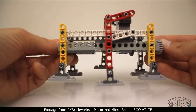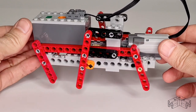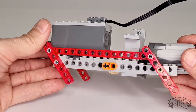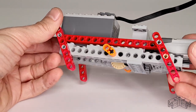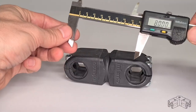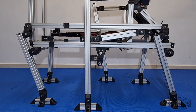This one is driven by a single motor. This didn't look too complicated, so I felt challenged to carry over this working principle to the Infento system, just in a bigger scale. There is a principal shaft that drives two cranks with 180-degree offset, one for each side. On the LEGO model, this crank has a radius of only one single LEGO stud, which is equivalent to 8 millimeters. I decided to use an Infento crank with 80 millimeters. And as this led to a 10-to-1 scale, I had to build everything else also in 10-to-1 scale.